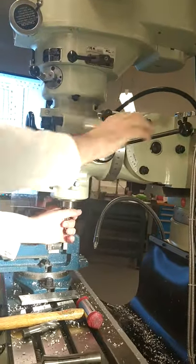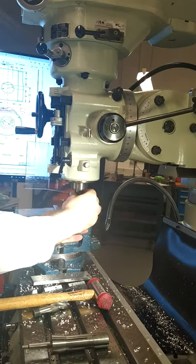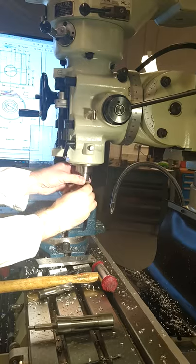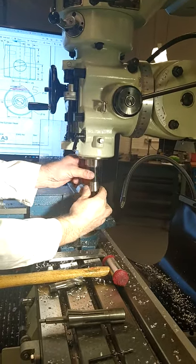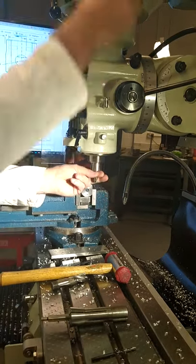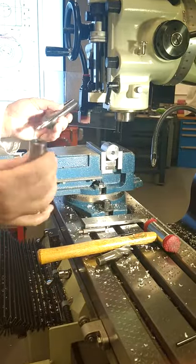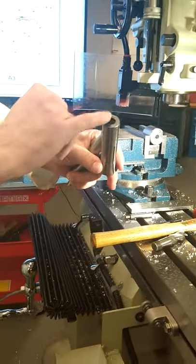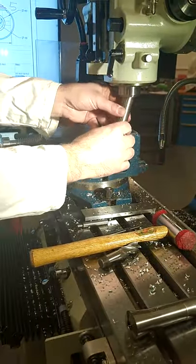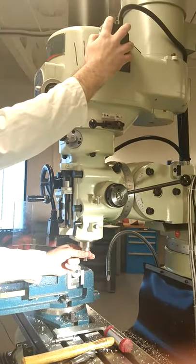So, the noise you hear from that, the tool must be fully up and locked, and you push the collet up into the spindle. Now, this can happen. I have to replace that R8 collet because sometimes the thread can get damaged in those. I've got a new collet to solve that issue. So as you press up, it should feed up into the machine and the white button starts it off.